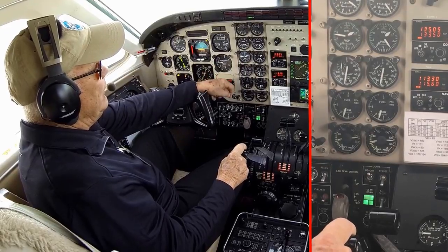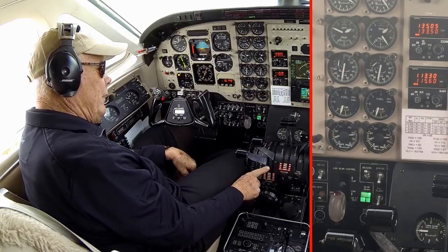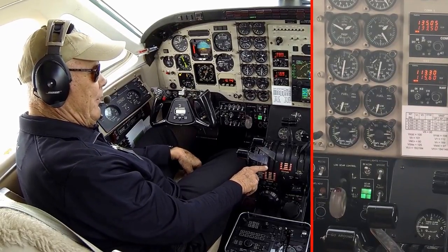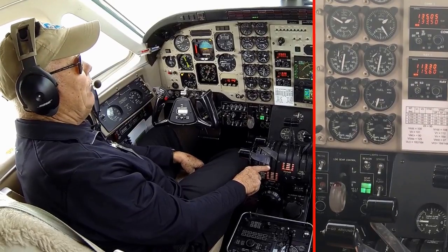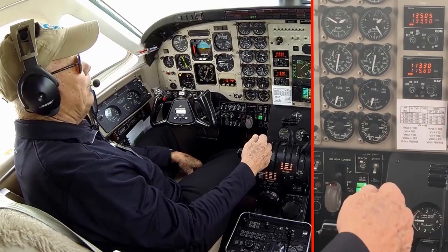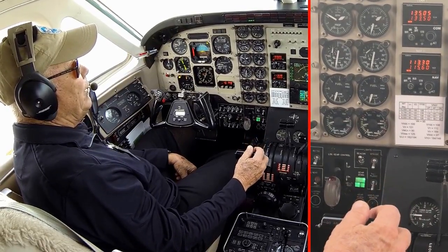Now if I come forward, it rises again. So this airplane, it appears to be that the tail end of my power lever shaft is about the letter F when it's at that truly flat pitch position. All right. Let's try the other side too. Come back here. It'd be nice if they're absolutely identical. Rarely is that the case, but we hope to get pretty close together.